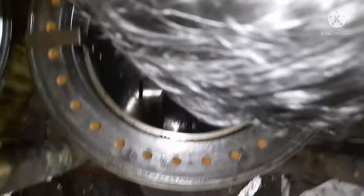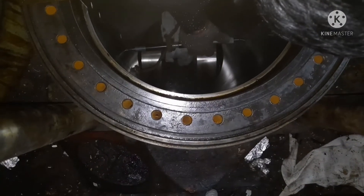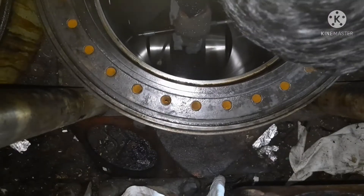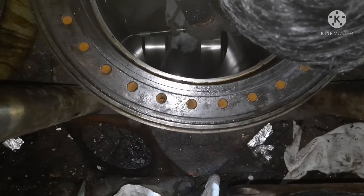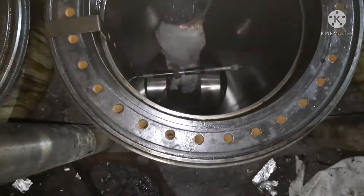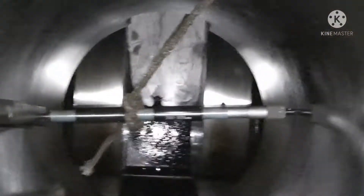This is the fourth parameter — the last, bottom-most reading for the cylinder liner. The bore gauge got slipped, but since I tied it with a rope it is still under control and has not fallen down. The last reading is now in place.